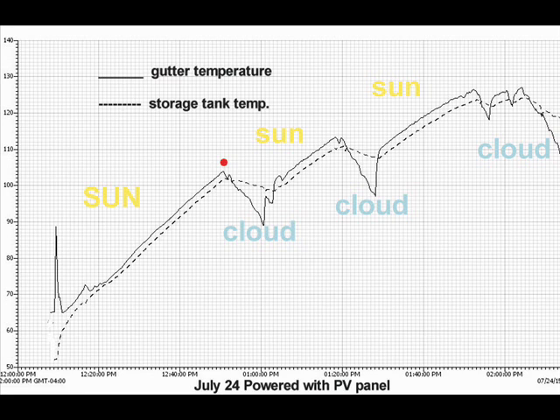Basically, we're getting more of a net heat gain by connecting our pump directly to a photovoltaic panel. If we don't have a photovoltaic panel, we could use a differential controller. And even with a photovoltaic panel, we could use a differential controller to improve our heat collection efficiency. These are a few ideas I'm throwing out — continue the struggle to capture the sun's energy. Please visit my website, JC Solar Homes. Thank you for your time. Have a sunny day.